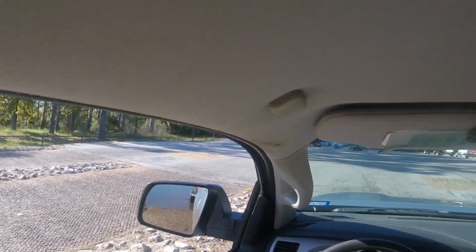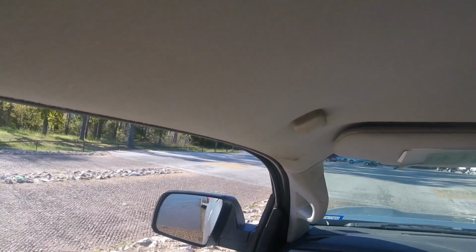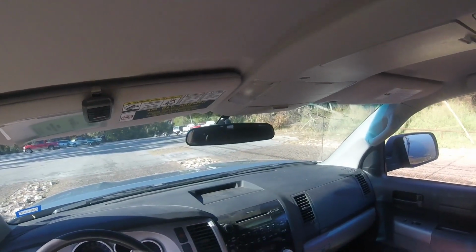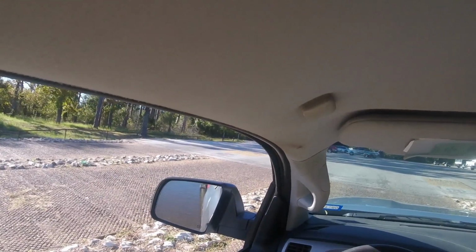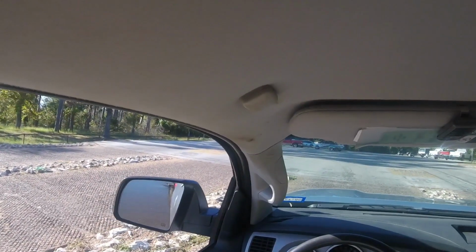And then as you're going down, you'll probably want to put the boat where the water comes up to about the top of the fender and then stop. You'll understand as you go along a little later how far your trailer needs to be in the water for your boat to load properly. So now let's pull it back out again.